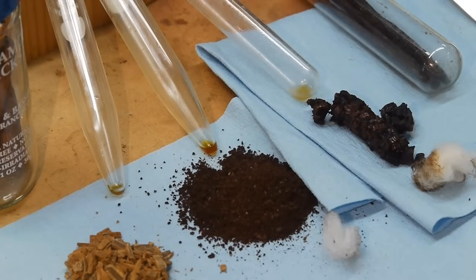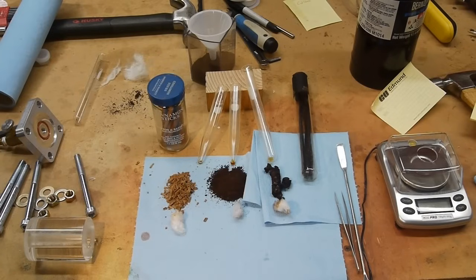So there are a few more things to work on. Ideally the chamber should be stainless steel or something else, so that the pressure and temperature can be higher, and also so that it doesn't dissolve into the supercritical CO2. You could actually have something that would be long-lasting, but the basic idea is here — you pack a reservoir full of dry ice, which you can get anywhere, even grocery stores have it now, and then seal it all up and do your extraction without any unusual equipment. One problem will be the overall yield; you're only going to get a few percent of mass of what you start with. So your extract is extremely concentrated, and I'm not really sure how you would use it — whether in cooking, perfume manufacture, or something like that, it would have to be very small quantities. Or the chamber would have to be much larger, and maybe using stainless steel, the extraction chamber could be five or ten times as big.